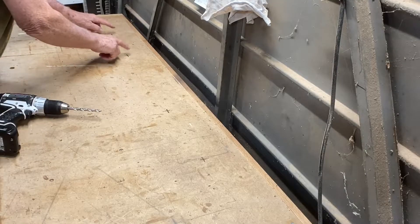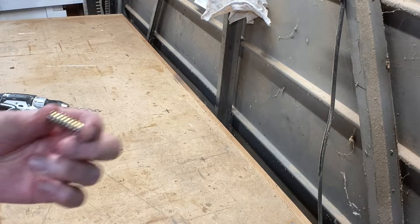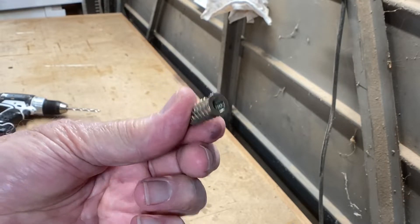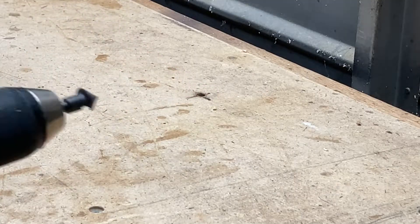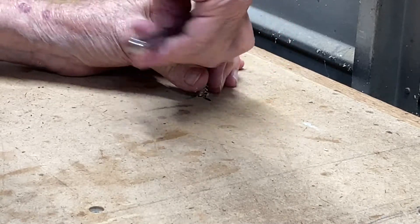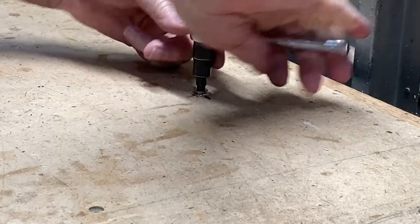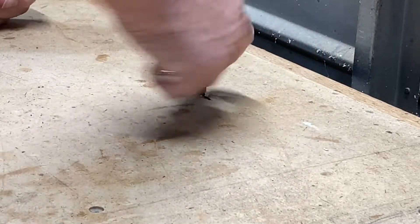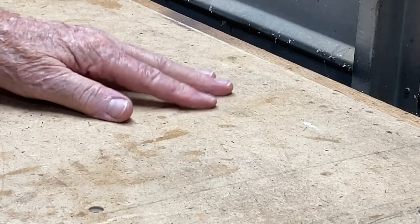The first thing I've done is I've marked four spots across the back of the bench and I'm going to drill those out and install these threaded inserts. After I've drilled the hole, I'm going to countersink it just a little bit, then I'll screw in the insert. I put some beeswax on this to help it go in easier, and the countersink will allow it to drop just below the top of the bench. Now I've got a nice flat surface with an insert in there.